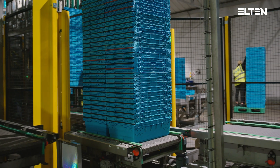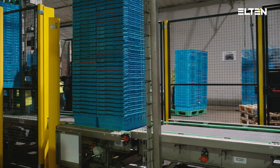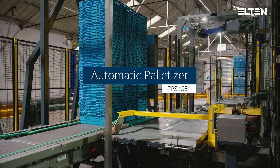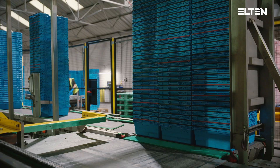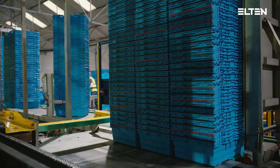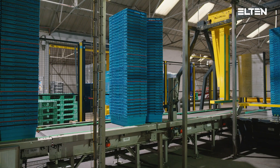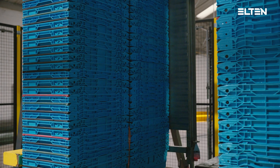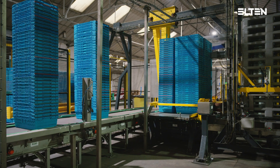The T-car turns two stack lines into one line again, and the stacks will be aligned for loading on the pallet. Three stacks are aligned with the long side leading and are pushed on the next pusher plate. When ready, two stacks will be turned to the short side leading and pushed on the pusher plate to make the complete load fit for one pallet.